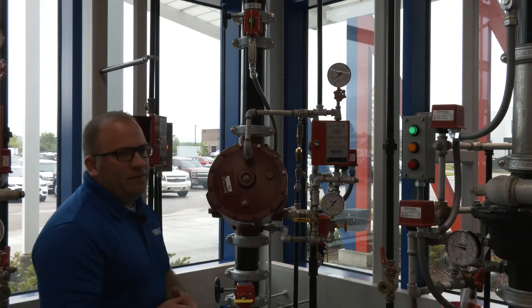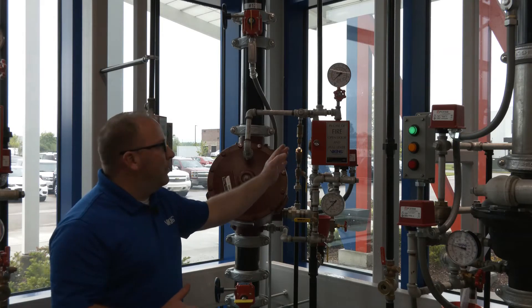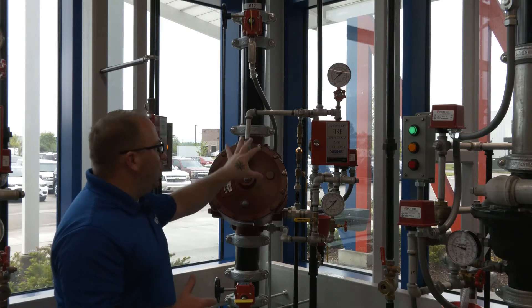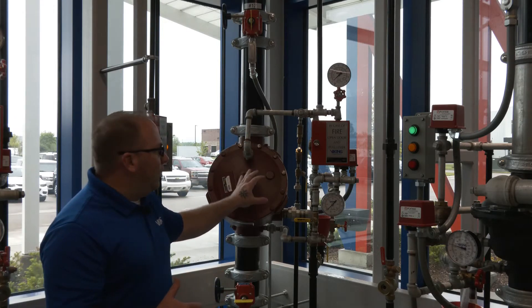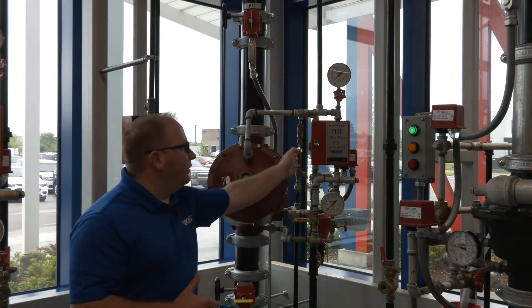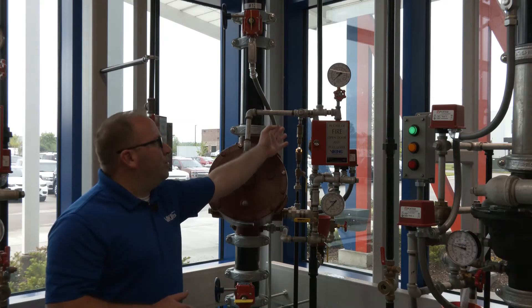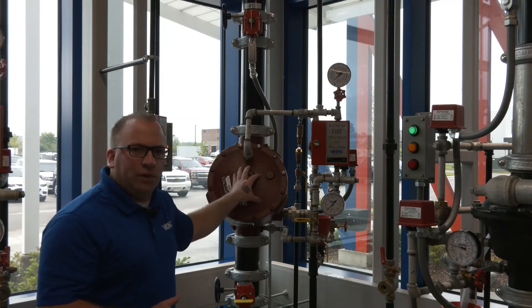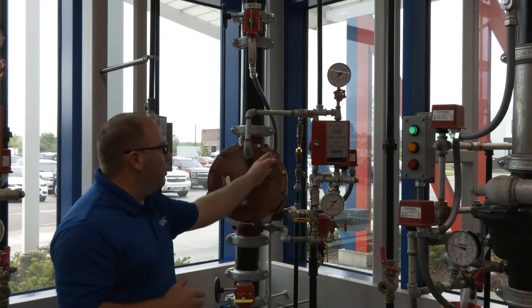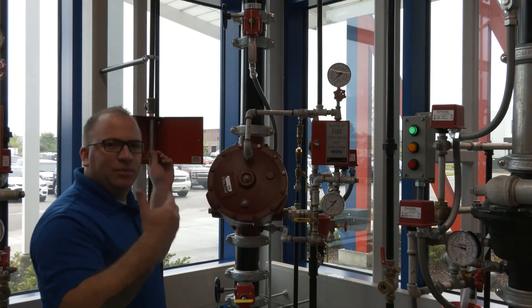With the system completely shut down, restoring the system is actually very simple. We have the prime water valve in the open position, so we have prime water pressure coming into the system piping. We're going to use that prime water pressure to fill the pilot line piping so that we can hold the valve in the closed position. As the water passes through that prime water valve, it goes through a strainer or restricted orifice and a check valve. That restricted orifice controls all the water pressure that comes into the valve to hold it closed in the prime chamber.